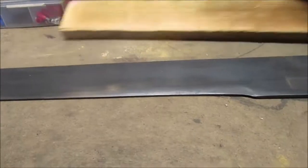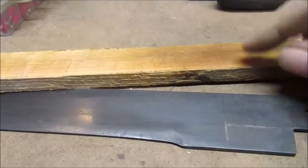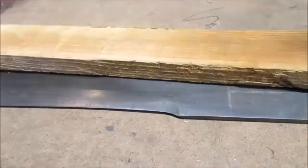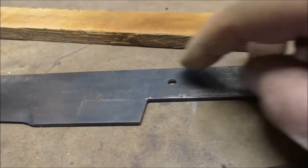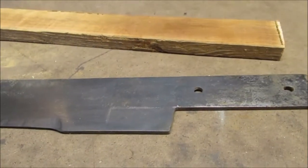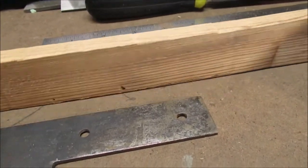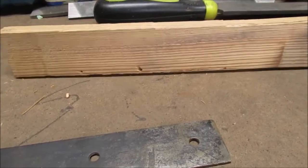I'm thinking this would be wide enough for two of these because we're gonna shave a lot off - it's gonna be curved over. We'll put the straightest part at the top and then it'll be shaped. We'll probably have to redrill a hole somewhere - two pins don't look like enough and I got my carbide bit. We had to cut a little sliver off there, like an eighth of an inch. That'll be on the top and this bad spot will go towards the inside - we don't really care about a few wormholes.